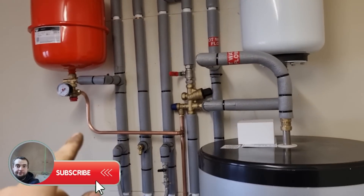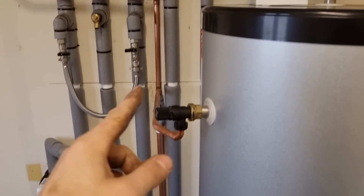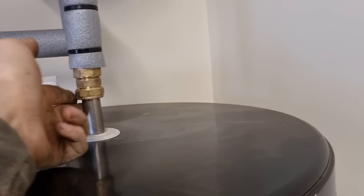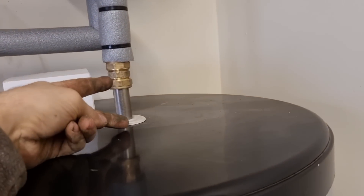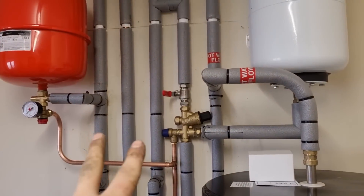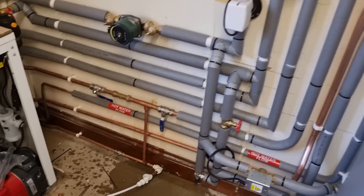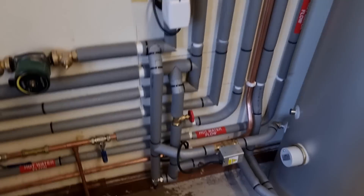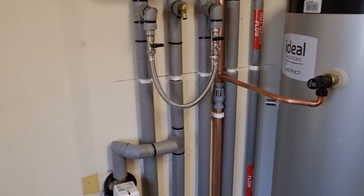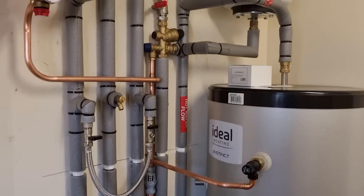That's got this little job all sorted. I've been round and labelled up all my pipework. I've only got hot water flow tape in the van so I need to pick some cold tape up. I still need to put a clip-on thermometer on here — this cylinder needs to be kept at 60 degrees. I've made the best job of the lagging. I've just tied the cold in temporarily, still got a foot of Shore Stop on this. We're pretty much there with the boiler — still got oil line and condense to do, and all the wiring.